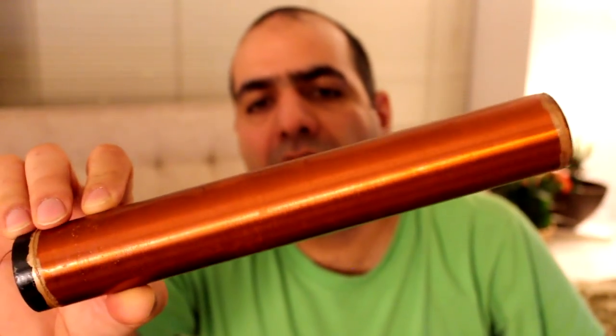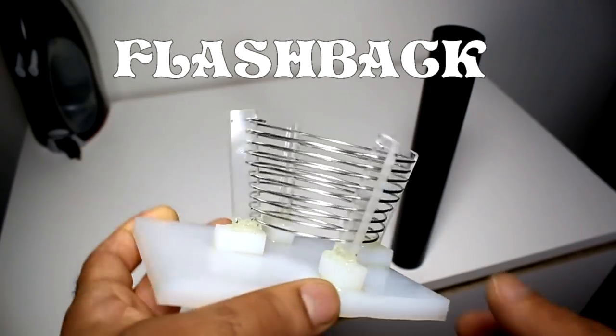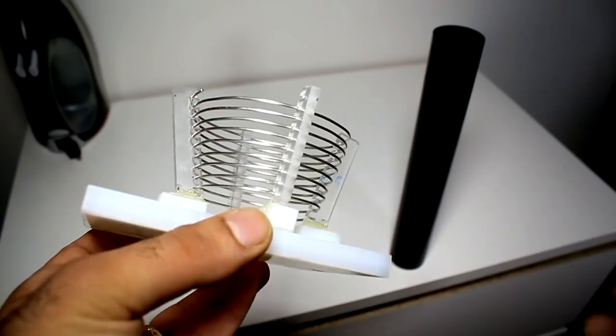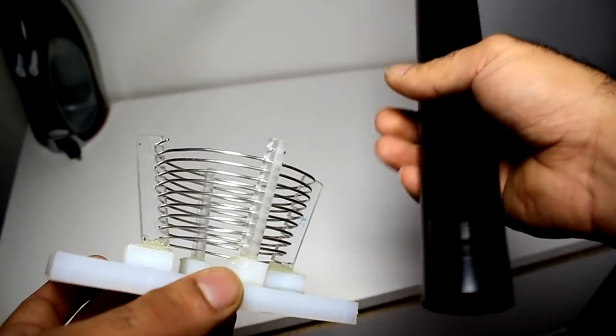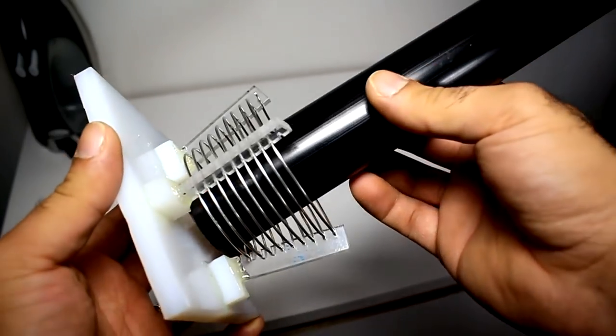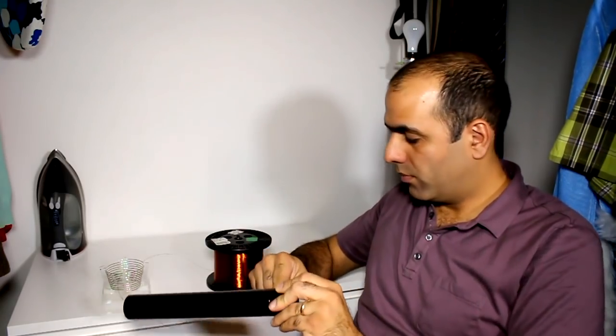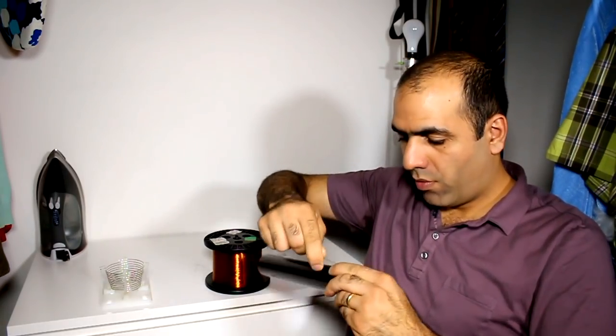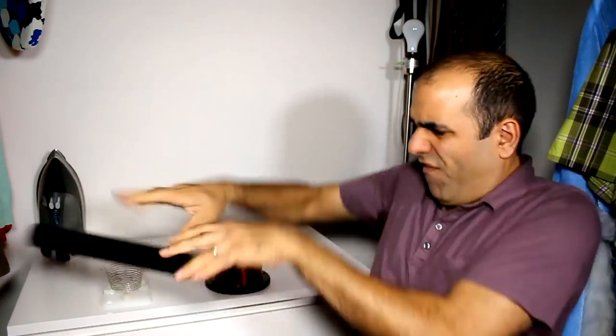I built my original secondary winding at around 700 turns with 28-gauge wire. I made this structure, which is basically the primary of my transformer with 10 windings, and then I'll wind the secondary around this PVC pipe, which will be mounted like this. One turn... two turns... three turns... forget it, this is gonna take too long.